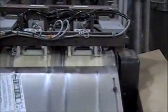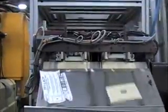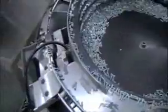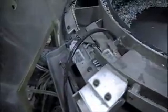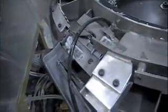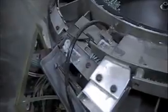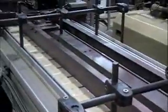Once cooled, the plates are directed to the screw station where mounting screws are installed. A vibratory bowl is designed to correctly orient the wall plate screws so they can be pre-installed into the wall plate. An inline sensor checks that the correct number of screws is installed. Plates that are missing screws are kicked out. These plates are then collected and resent through the screw station.